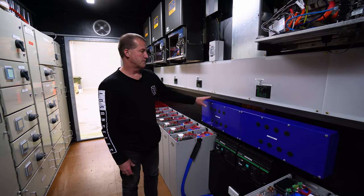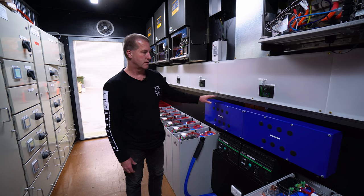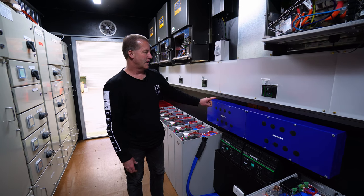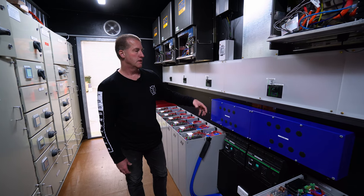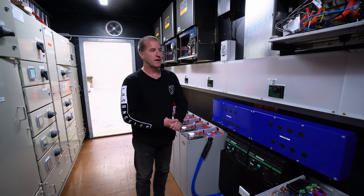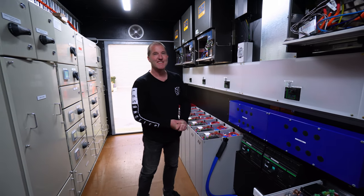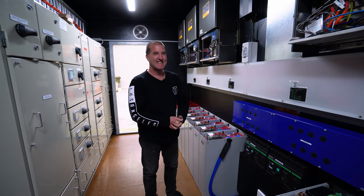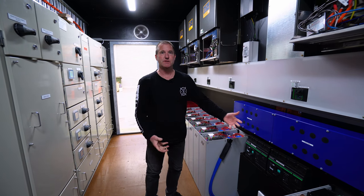And so we took this bus duct system to the TUV labs in Heidelberg in Victoria, not Heidelberg, Germany. And they did a test on them and it passed the test of a 50,000 amp, 800 volt short circuit. I think you showed me your little video of that being short circuited. Well, firstly we tested it as it was designed, which was with fuses, and it passed perfectly.